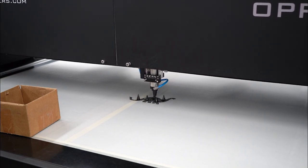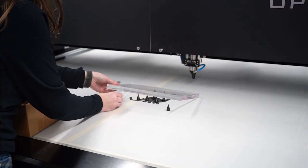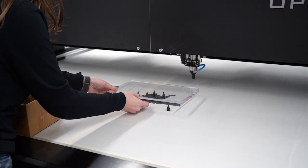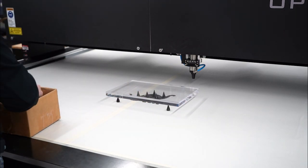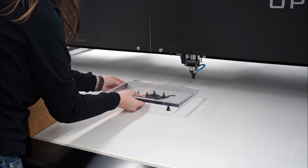When the beam hits the edge of the spacers it can burn the paper surrounding it. If we were to be cutting our material, the beam would hit those edges of paper and burn, resulting in a possible messy cut underneath the material. Now we'll put our material on top of the spacers.